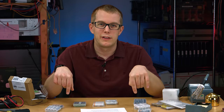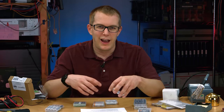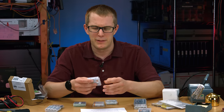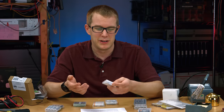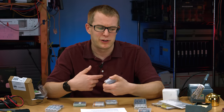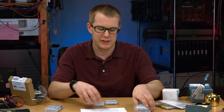Most of these cells said they have a thousand charge-discharge cycles, not 2,000 like I said in the narration — I forgot which ones are rated for 2,000, but one or two of these is. Anyway, it doesn't really matter because you're never going to reach a thousand. If these are in a solar light that recharges every day, maybe you'd get through a thousand over three years — but chances are the light won't last that long anyway. Going through a thousand charge and discharge cycles is probably never going to happen. It seems like an important specification, but it's really not, and for most of these batteries it's pretty much BS anyway.